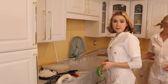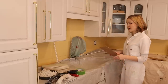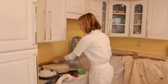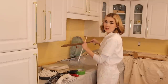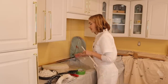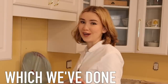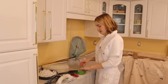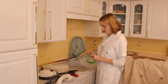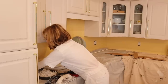Now that we have all the trim pieces cut, this is something we learned in the last probably two projects, and we learned this from a professional tiler. Basically, you take a piece of cardboard before you begin and put it at the bottom of your project so that you're backsplashing with the thickness of a piece of cardboard underneath. Because then when everything's said and done, you didn't just cement your backsplash to your countertop, which we've done before. This will make it so that you can have that little bead of silicone at the bottom, which makes it look very professional. And then if you ever want to change out your countertop, you're good. So I'm just going to tape ours down a little bit — this is kind of like a little bit of a hack.